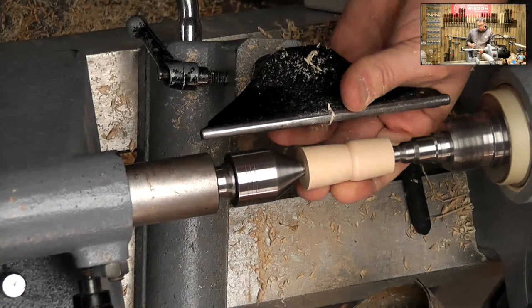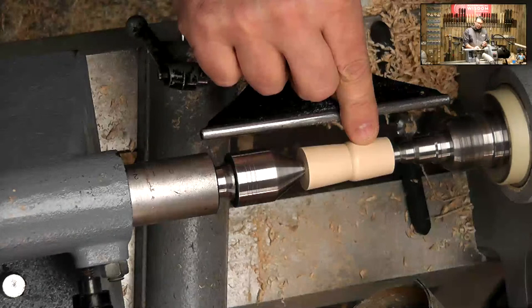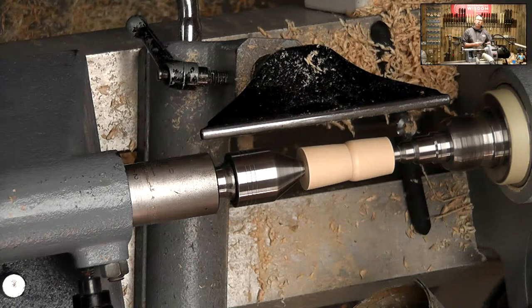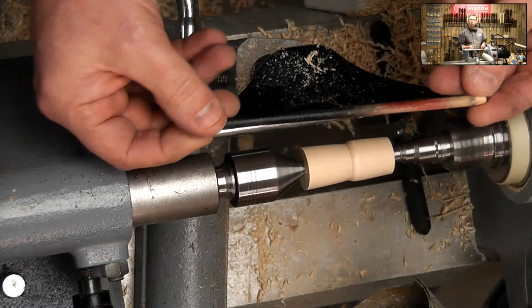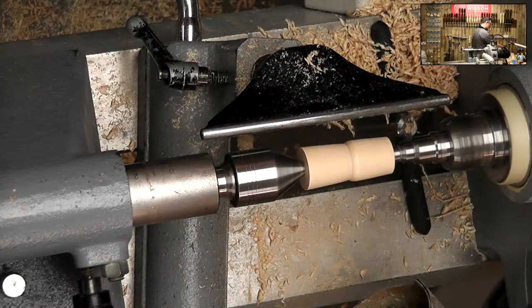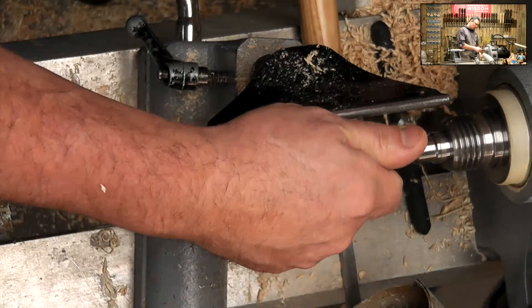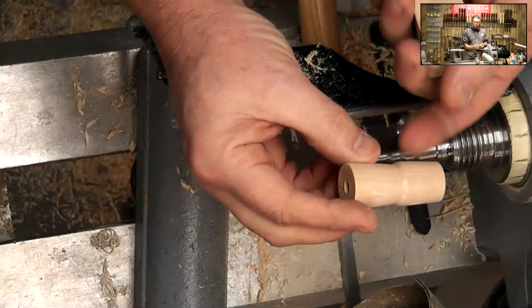Now, two-part, really, if you're sensible about this, two-part, because you can then paint that black or whatever color and then glue that onto it, and that line will be absolutely distinct and precise. What I would do here, though, is sand it, seal it, and paint it on the lathe, take it off, and let it dry. Use a paint stick. We've spoken about paint sticks before, so another bit of sacrificial dowel. Put that in the hole, stand it up somewhere to dry once you've painted it. So that would be a nice little way of doing that. I won't sand it. We'll just carry on now, and I'll do number two. There we are. So we need to repeat that process, do another one of those. So I'll keep that next to me.